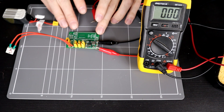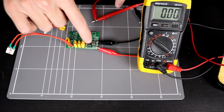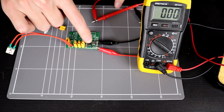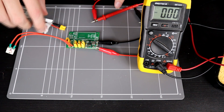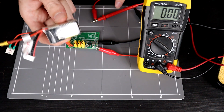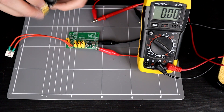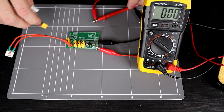The power distribution on this board is now mostly set up. I wanted to do a quick test because I've got a little variable set regulator at the end here, and I want to get that set before I put the Teensy in and accidentally blow it up — plugging the battery straight into the Teensy is definitely going to blow it up. I'm actually running 4S in the MeltyBrain for this iteration, just getting a little bit more speed and hopefully more translation.